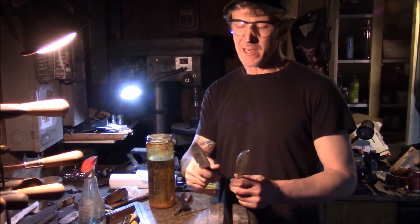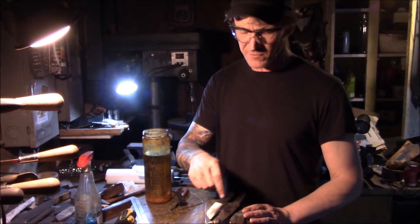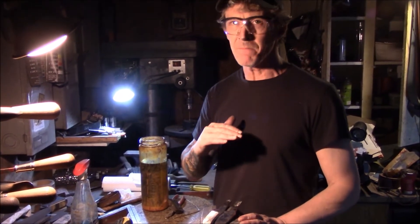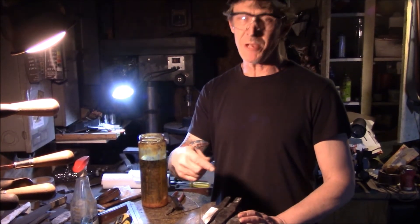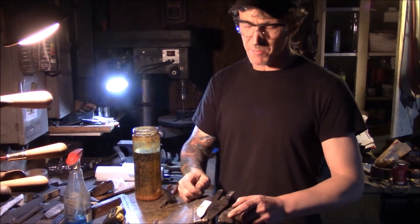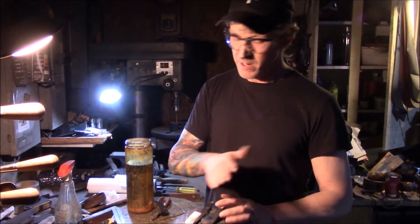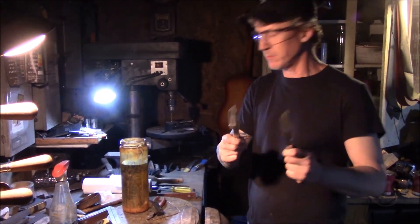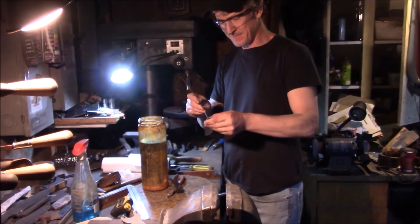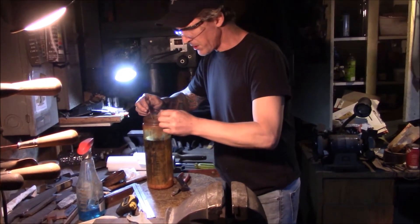The reason I wanted to stop here was because I want to show you what we're talking about when it comes to pattern development. I'm going to take both of these and put them into an acid etch. When you put this into an etch, it's going to start showing you the pattern on the surface of the steel. What a lot of people think about Damascus is that the pattern is only on the surface of the steel — it's not. It goes the whole way through that piece of steel. We have to do something to expose it and bring it to the top. I want to show you this one before a grind and this one after a grind so you can see the difference in the pattern after we've ground into that hollow and actually removed the steel. If you forged it in, the pattern would stay the same as what we have on the surface. If you grind it away, you expose what's down beneath the layers. It's like an onion — the more layers you peel back, the more it stinks.